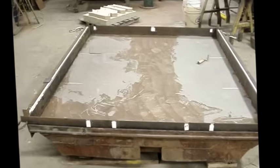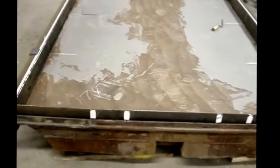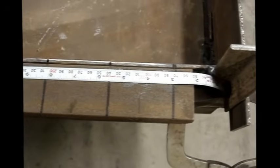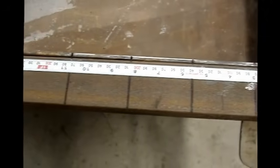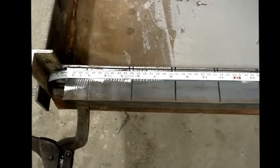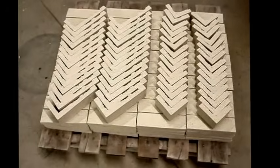This video explains how to build a precast thin brick panel. This is our panel frame — actually an empty kiln car frame. As you can see here as we zoom in, we've used metal measuring tapes and adhesive tapes, one located on either side of the frame. The tapes are used to strike reference lines to make a panel that looks like an actual brick wall, so we keep things level, straight, and square.